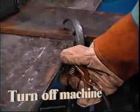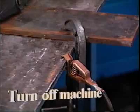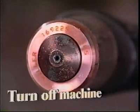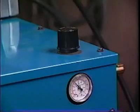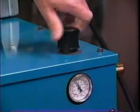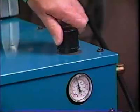Attempt to correct the problem by assuring that the workpiece clamp is secure and close to the cut, assuring the consumables are not worn and are installed correctly, adjusting air pressure, and/or adjusting the power source amperage. If your cutting speed is too fast, molten metal will splash back upward and possibly short-circuit the tip and electrode.